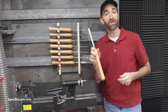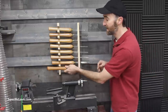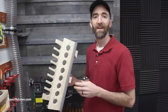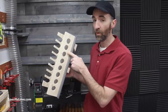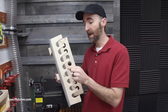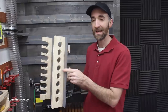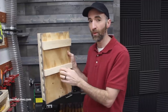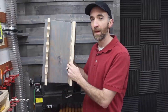If you like building with your lathe, here's a great way to store some of your high speed tools. It's a simple holder that has a hole in one side and a slot in the other for easy access so they won't fall off and stay organized. For the backing I'm using a simple piece of plywood, and for the supports just some simple 1xs. I used a Forstner bit to cut out the appropriate size holes for my tools on two pieces, and I cut some angles using my band saw. On the back I added not only the French cleat but an additional support so when it's on the wall and you're pulling your tools away, it gives a little more support against the wall.